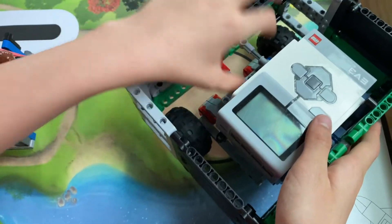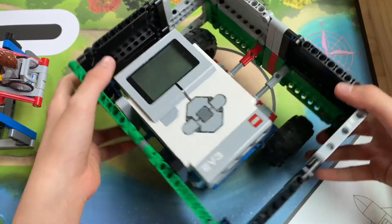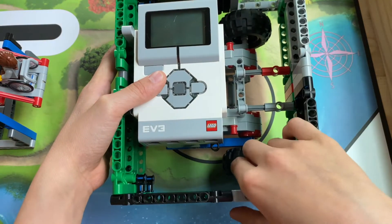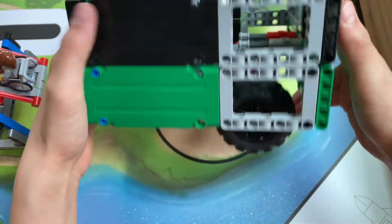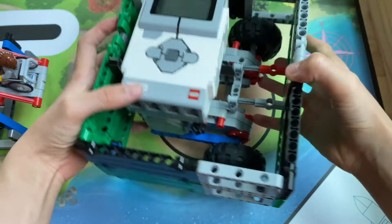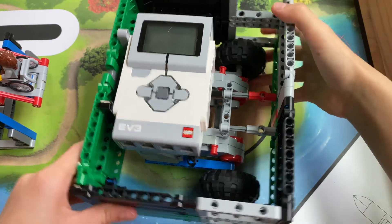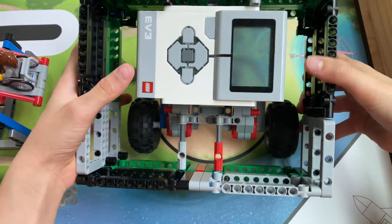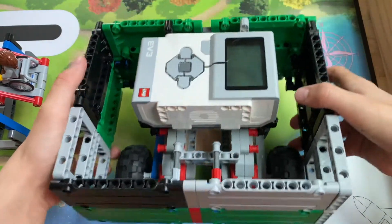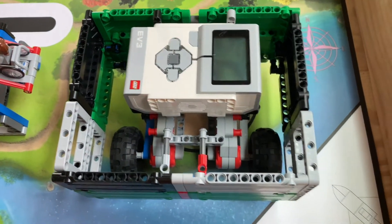Now that I have my box secure and connected, let's look at what it looks like. As you can see, it takes a lot more room than the robot. Although I did leave some space here, what you could do with this space is make an outer boundary and connect this axle to your box — that will make sure your wheel doesn't go into weird angles when the weight from the robot pushes down on it. It also needs a little bit of space between the wheels and the front, and although some of that space can be removed, most of it can't. So it will make your robot larger, which can be a disadvantage in FLL.